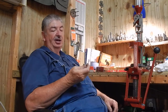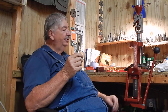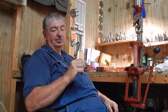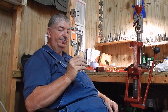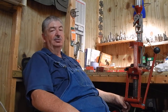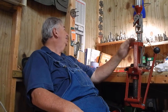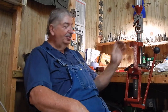I made that out of a piece of three-quarter inch stainless, turned it down to the original bushing dimensions. I think I drilled it with about a three-eighths bit and then put a little taper in it for the case. If you've got a friend with a little mini lathe or machine lathe, these are real easy to make and don't take that much time. Now I can use my progressive press for 17 Hornet, and it's made a big difference in my production.